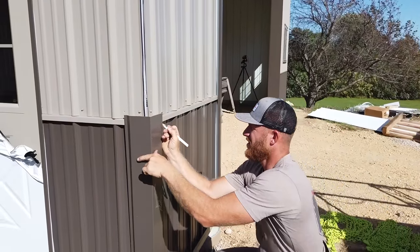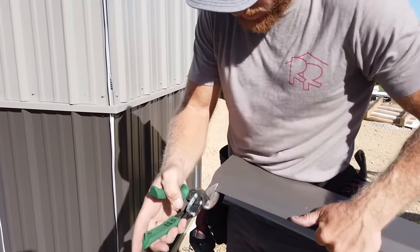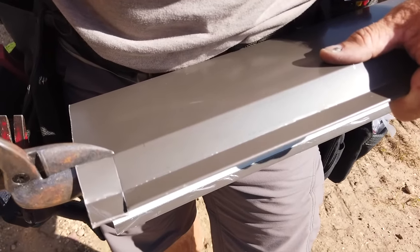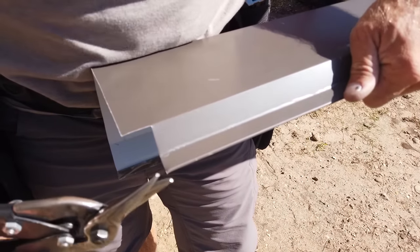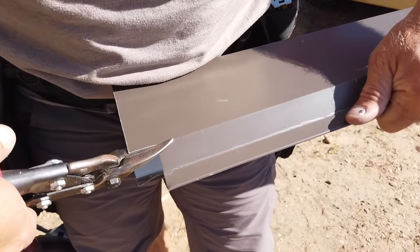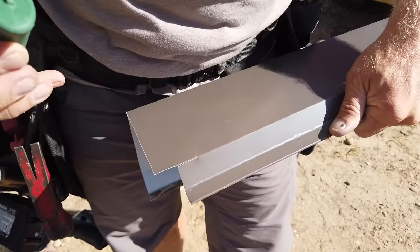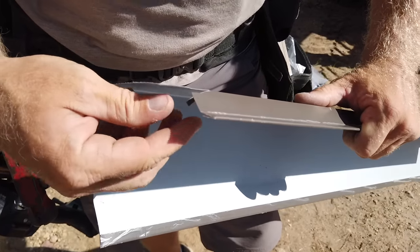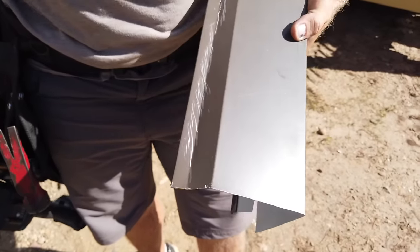Let me mark this side. Now with those marks — same sort of thing — I'm going to cut this out but it's a little bit different. First I'm going to make my cut into my bend here. Then I'm going to take my reds — the reds are important for this cut because I'm going to make a little double slit on this metal to this mark and I want it to roll inside. Then I'm going to take my greens. You see how it pushed this side down and this side up — it's going to do the exact opposite on this side. So now I've got this nice little slit that I'm going to bend in. What I'm doing is creating a nice rolled edge right here instead of a cut edge.